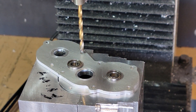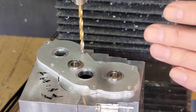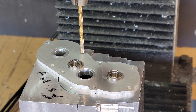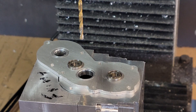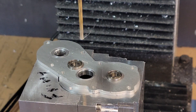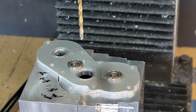When I match drill, I bring the drill down, look at it from this direction and then from this direction, see if there's any bit deflection, and then fine tune the table. Now we need to be careful. There is a clearance drill, and then there is a smaller drill used to drill a hole that will be tapped. Right now I've got the clearance drill — the larger drill — in the chuck. I will go down and use it as a spot drill. I'll go through the clearance hole in the plate and just spot drill the crankcase with it. Then later I will use the smaller drill to drill the hole and then tap it.